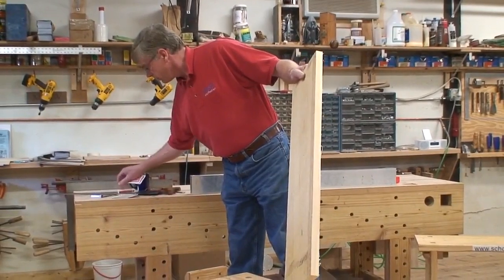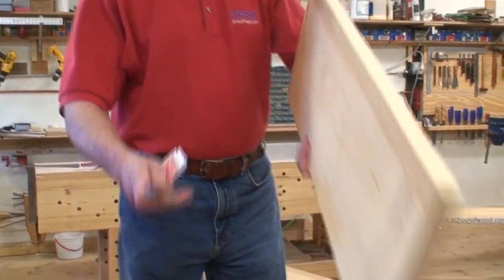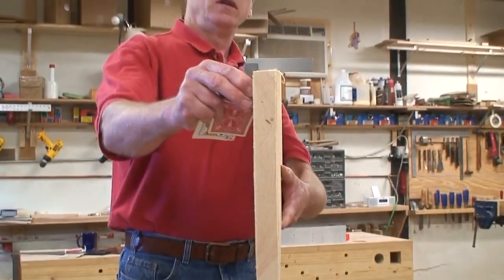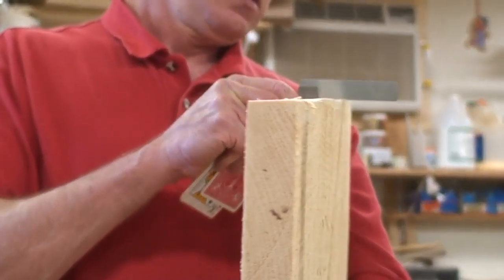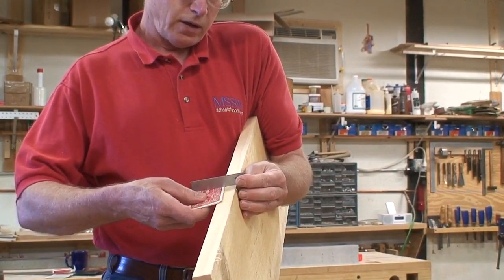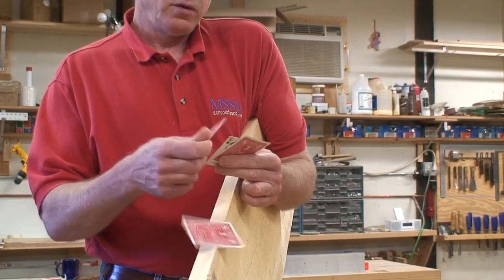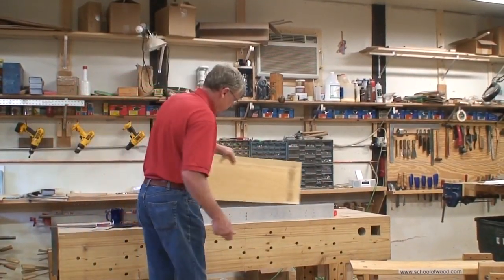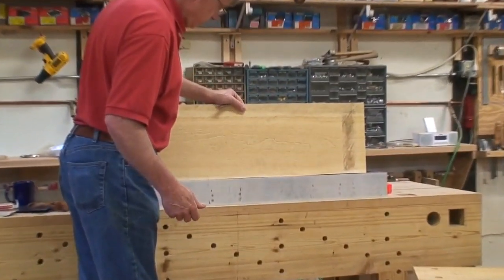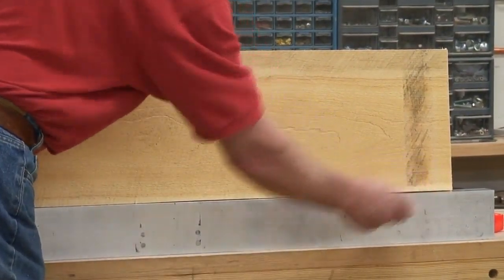Using playing cards and a little square, we will look for the point of greatest deviation from square. Looks like I angled all along there, so we put in playing cards to see how far off I was — one, two, three, four, five cards. And we will place the wood on a beam like this to see how straight it is — that's about six cards there.